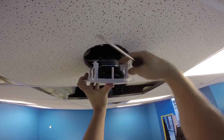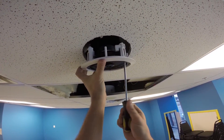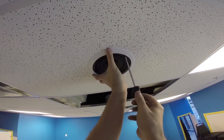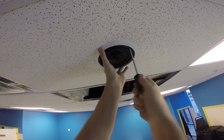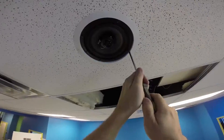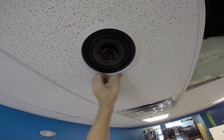I'm going to lift it up and put it into place. I've got to make sure that these tabs are in the middle and not off to the side so it fits up in the hole. When I put a screwdriver in here and tighten these screws, the tabs flip out and squeeze down onto that metal support and the ceiling tile on the other side — that's what holds the speaker in place. I'm tightening and tightening. I really should be using an electric power screwdriver, so I'm going to fast forward this a little bit.